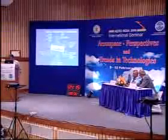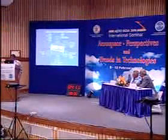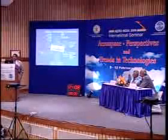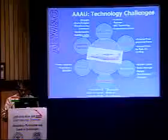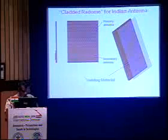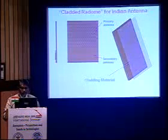The other aspect, which normally probably wouldn't have worried us in an antenna, is rain erosion, because the antenna surface is going to be constantly going through rain erosion, temperature changes, static discharges, and most of all, lightning strikes. Similar to that, we have got a power supply inside. What we did is, when we have got an effective way of cooling, we push the power supply also inside. Thereby, we have to have our system more efficient in terms of EMI/EMC. One of the important things that we did is the clad antenna, because we have to reduce the space and the drag.